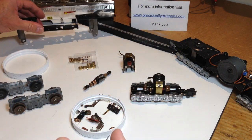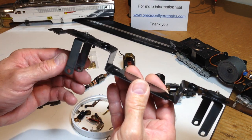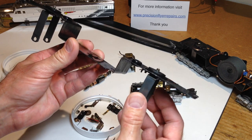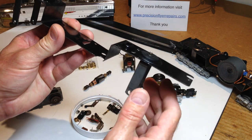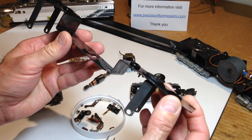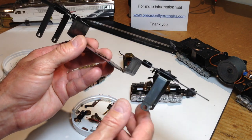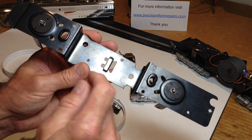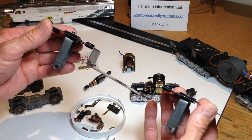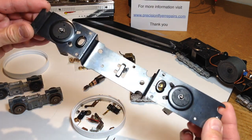This is the frame off that 360 — a piece of sheet metal that's been formed, onto which the two motor yokes are still attached. There's a lock washer, then insulating washers, one on the bottom and one on the top. You may notice nylon grommets here, which I install to protect the rainbow wires passing through from the potentially sharp edges of the holes stamped out of the frame. This is a dual motor, dual power truck Gilbert Diesel chassis.